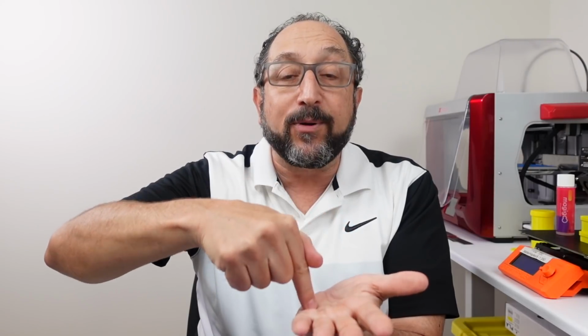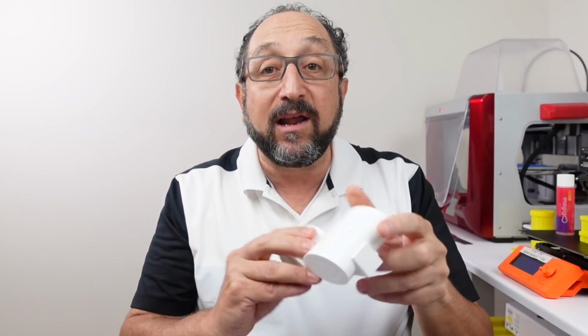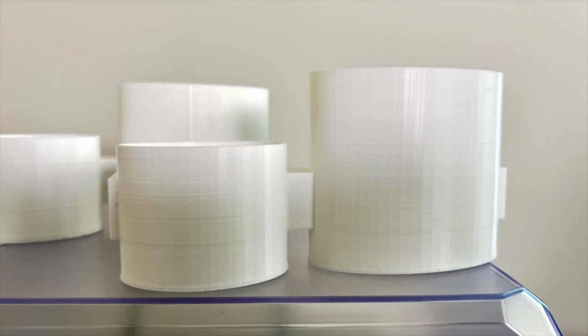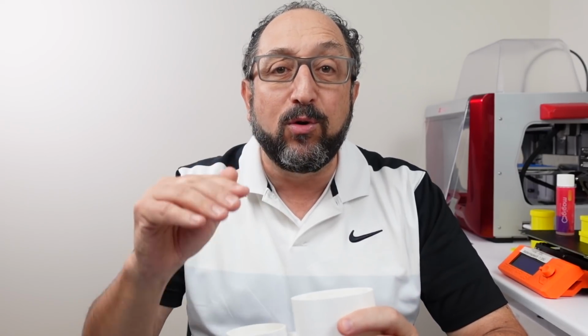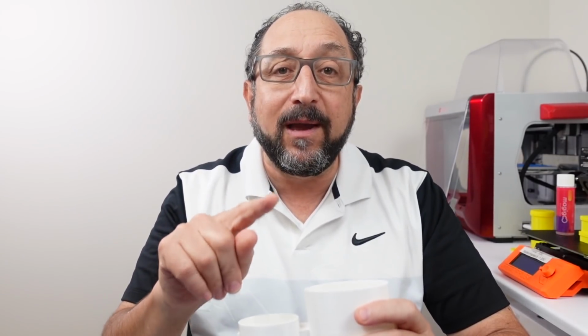That combines with the ability to move the print head to a precise location. And while the print head is moving, ideally, you want no filament flow. Filament flow while the print head is moving causes stringing. So our ability to control these two characteristics of your 3D printer will go a long ways towards determining the quality of your print. And in the future, as you look through 100+ parameters in your favorite slicer, think about the impact on filament flow and positioning.